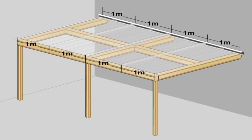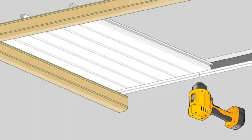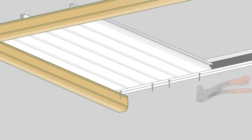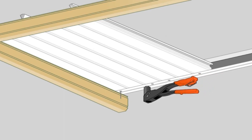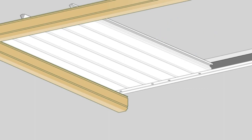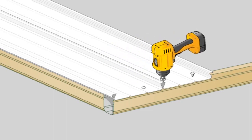Mark the back channel and front fascia beam every one metre to ensure the roof sheets are laid square. Lift the first sheet into place and slide it firmly into the BIP foam in the back channel to guarantee weatherproofing. Check the sheet is square against the back channel and side fascia beam. At the back channel end, rivet the roof sheets from underneath through the raised edge of the bottom of the back channel with two 3.2mm rivets per pan. Seal rivets with silicone. At each supporting beam, fasten the sheet with two 12x20mm hex head self-drilling screws per pan and remove any swarf.